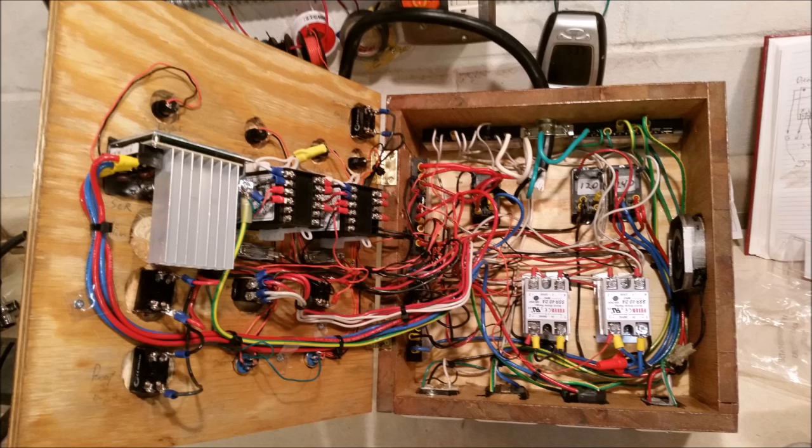You'll notice, well, I don't know if you can see from this picture, but the brass hinges, when I went to close the lid with all the wires, the little short 3/4 inch or half-inch screws that come with the hinges did not want to hold them in place and kept coming out and eventually stripped. I ended up going out and buying some 1.5 inch long brass screws for those hinges and screwing it way down into the plywood, and that's held it in place really nice.